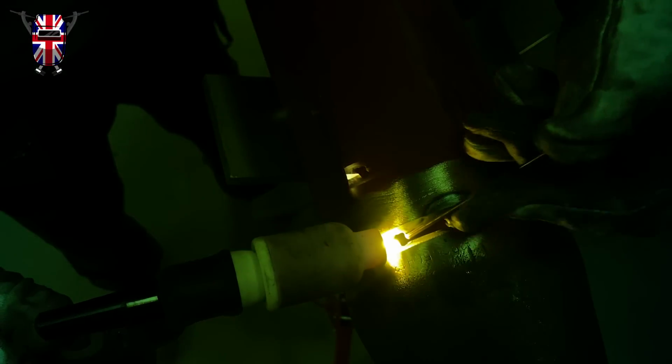And my tungsten, I don't even know what angle I sharpen it to. I don't really have a specific angle. I sharpen it up on a bench grinder, so it comes out to whatever it comes out at. I don't have one of those tungsten sharpening machines. I don't really see the point. The only reason I can see they do well is on site when you haven't really got a bench grinder instead of using a hand grinder. They do come out a lot nicer,